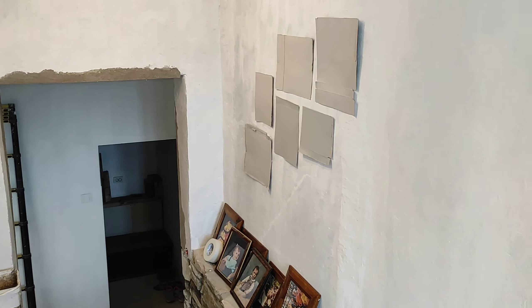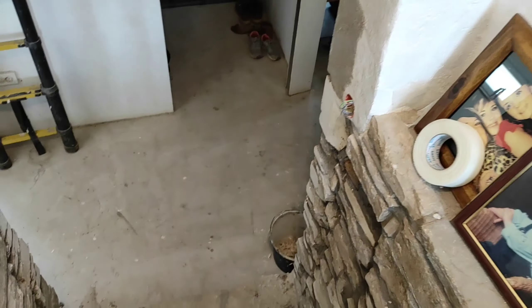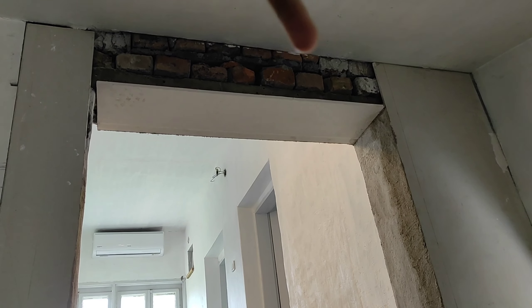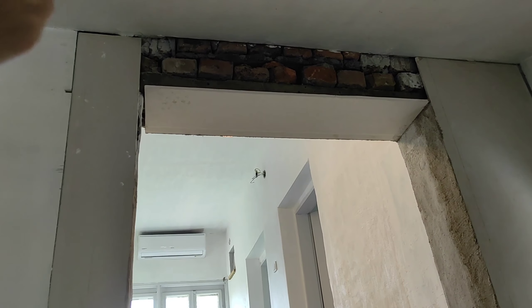So we've actually run out of our last bag — we've got a cup of plasterboard adhesive left. So we're kind of trapped now until the next time we go to the builder's merchant. That will allow us to finish off this top corner, building that up. It will also allow us to dob over the seams — you can see there's a bit of tape there and I've taped up the side. We also want to build up here, like I said earlier, so it's not a huge void. I've taped down there ready as well. So that's a bit of an update on the hallway, as far as we've got for now. Stay tuned and we should be topping it up and finishing off pretty soon.